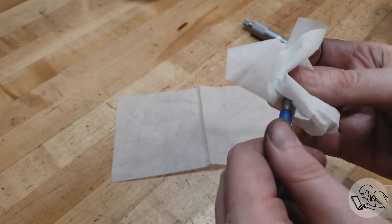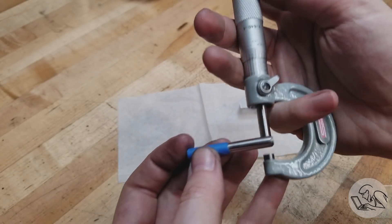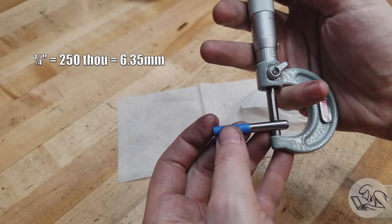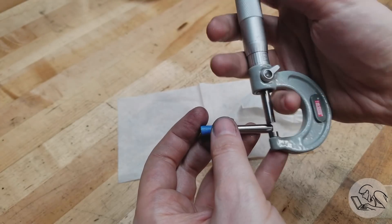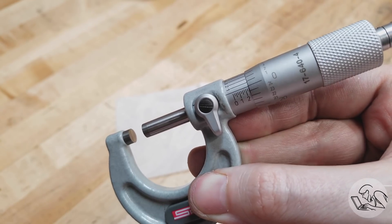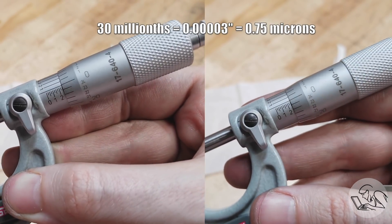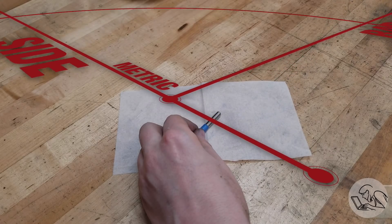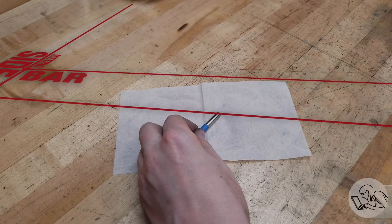Let's make some chips. I'm going to show you the five main fits that the hobbyist really needs to know about — how to achieve those fits, where they're used, and so on. I'm going to calibrate all of this to a quarter-inch shaft, because that's a good typical size of part you might be making in a hobby machine shop. We have two variables — the hole and the shaft — and it's easier if we hold one constant and modify the other. I made this measuring shaft for this purpose. I turned it on my lathe with emery paper to as close as I could get to perfectly on 250 thou all the way down. On screen I'll also show the ISO metric equivalents, calibrated to a six-millimeter shaft.